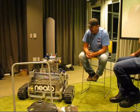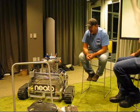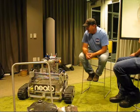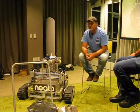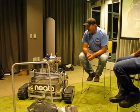And you're limited in the SRRC competition to 2 meters per second. We limit this to about 1 meter per second for various reasons. So there are 2 motors that drive the tread there. They're Animatics smart motors, a previous generation, which was a bit of a challenge trying to find documentation and get them to work.